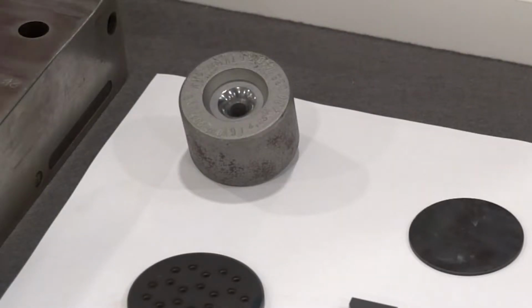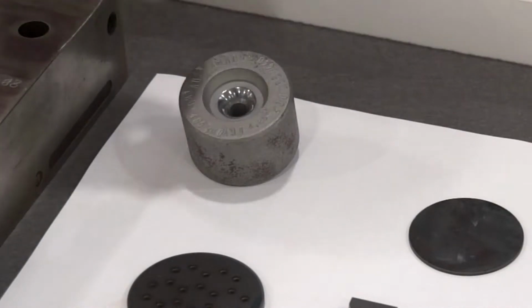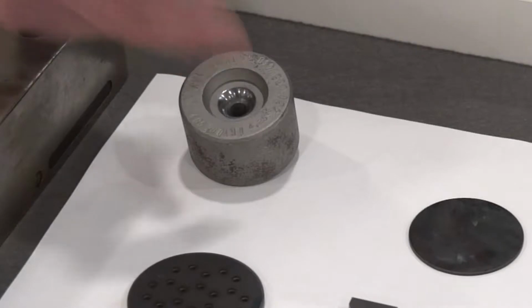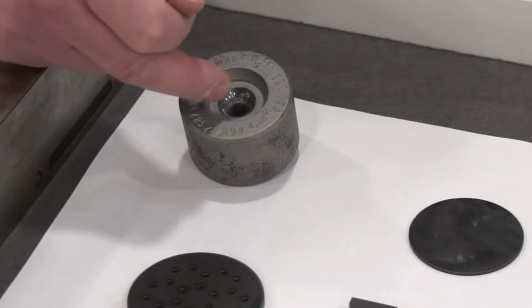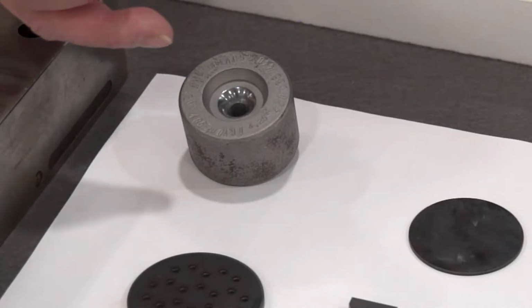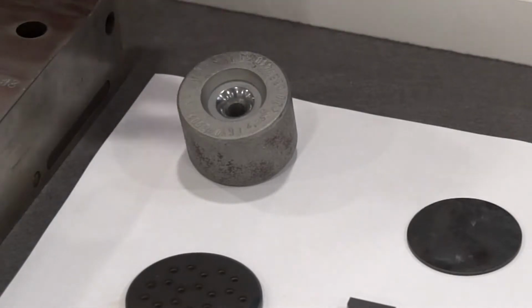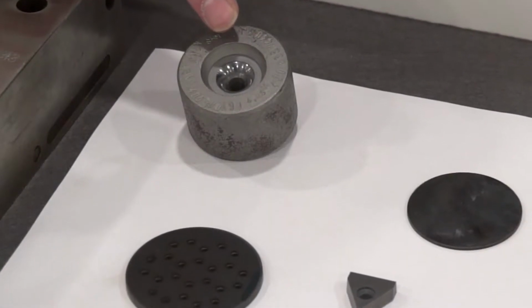And what are these smaller parts on the end? So the smaller parts represent, I would say, the more exotic materials. When I say exotic, carbide is the first one, which is becoming more and more of a standard. So here we have an example of a roping die. It's a steel outer body with a carbide insert. And that carbide insert would first be rough EDM'd with copper tungsten electrodes, and then finished down to a surface finish of around 0.2 Ra. Then it'll probably have the final polishing.